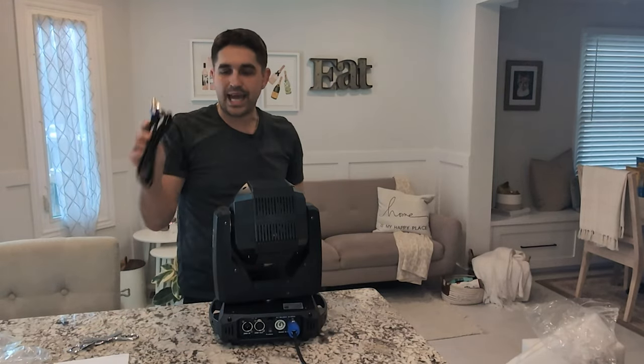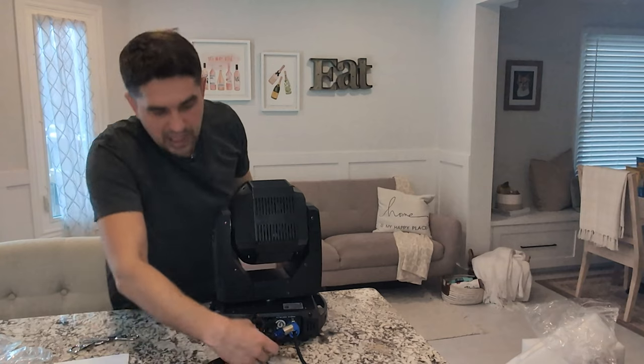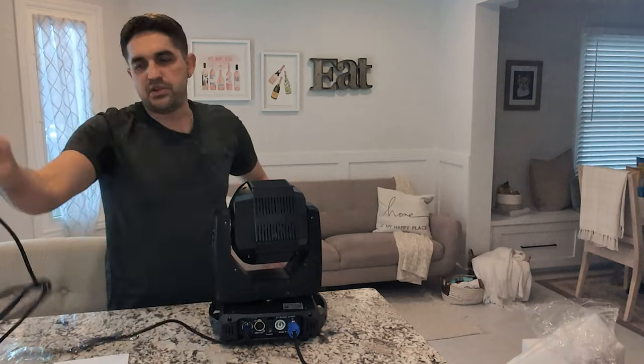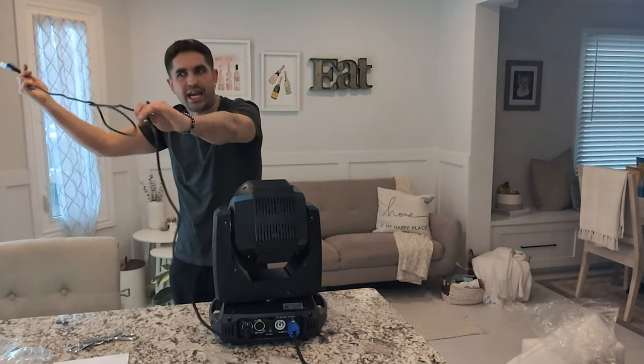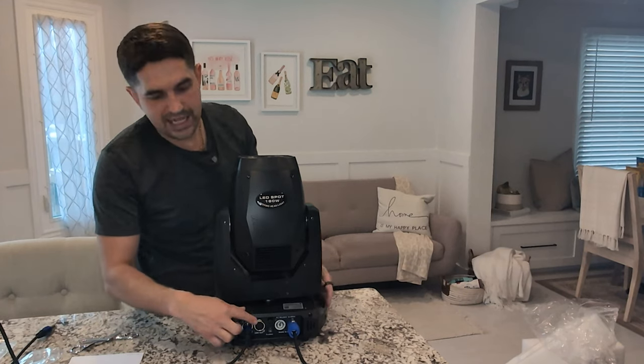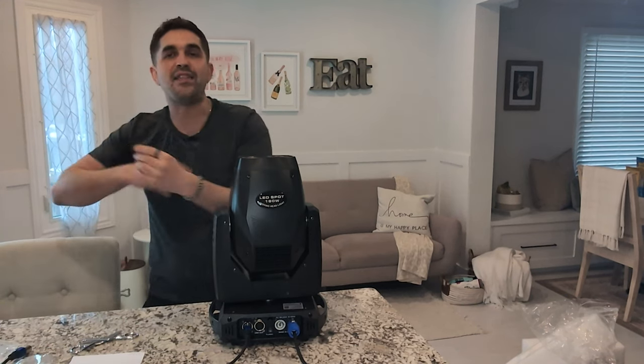You've got your DMX cables, but I use Donner wireless DMX so you don't need cables at all. With DMX lighting, it'll daisy chain itself to the next light. When you're creating a lighting show, every light goes into a daisy chain. Depending how many channels your light has, that dictates the addressing. So if this were a 24-channel light, you'd set it to channels 1 through 24, then plug into the next light, which would start at channel 25.